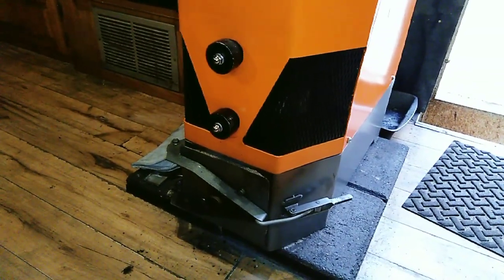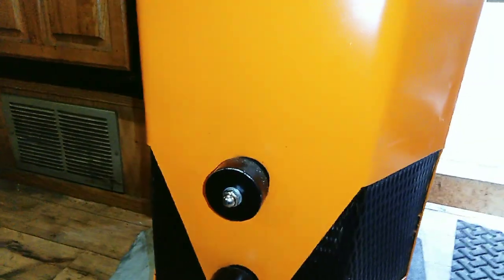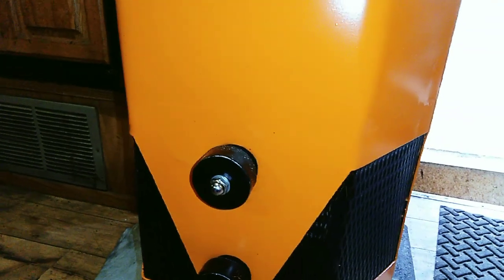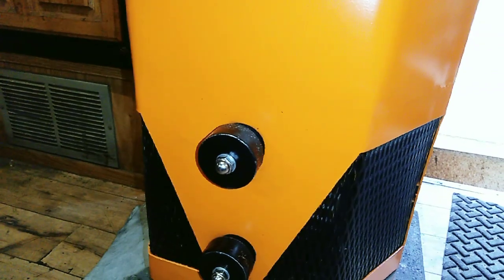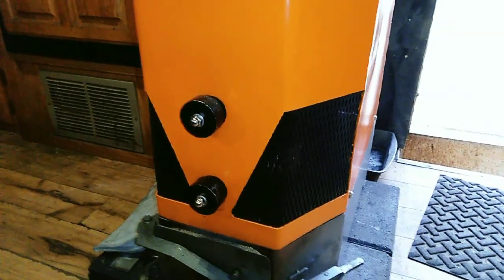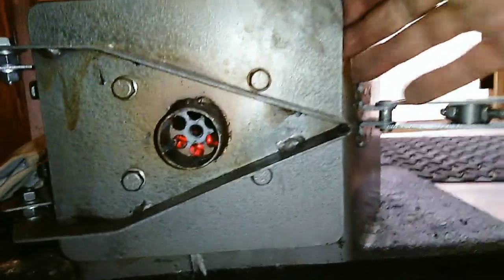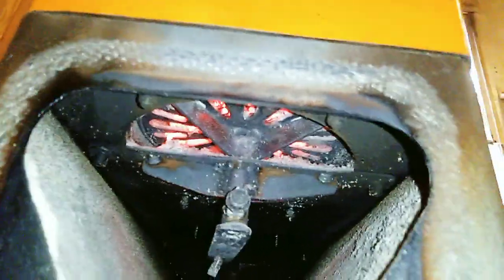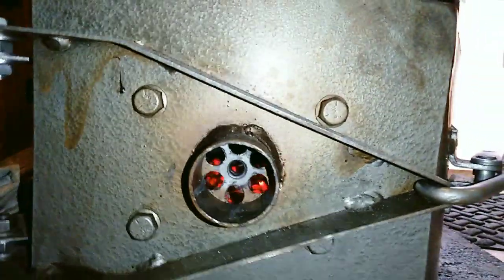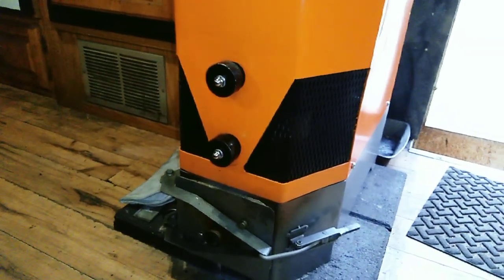It has a three-stage combustion process. You've got your primary oxidation zone — that's the hearth — where we oxidize the raw fuels, strip it down to carbon, and produce our raw gases. Then we have a grate in the bottom. You can see the grate there — that's holding up the carbon. We oxidize the carbon through this intake, which gets it nice and hot for all the gases to flow through. The CO2 has its oxygen stripped out and combined with carbon to create CO.